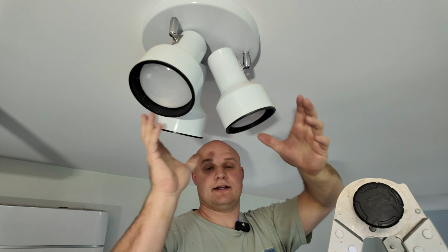So now I got all my wires out and exposed. I got my hot, my neutral, and my ground, and then there's 2 wires of each coming out. That's because all the lights tie together. So now I'm gonna take my panel and slide it on and take the screws that they provided, start screwing it in the hole.